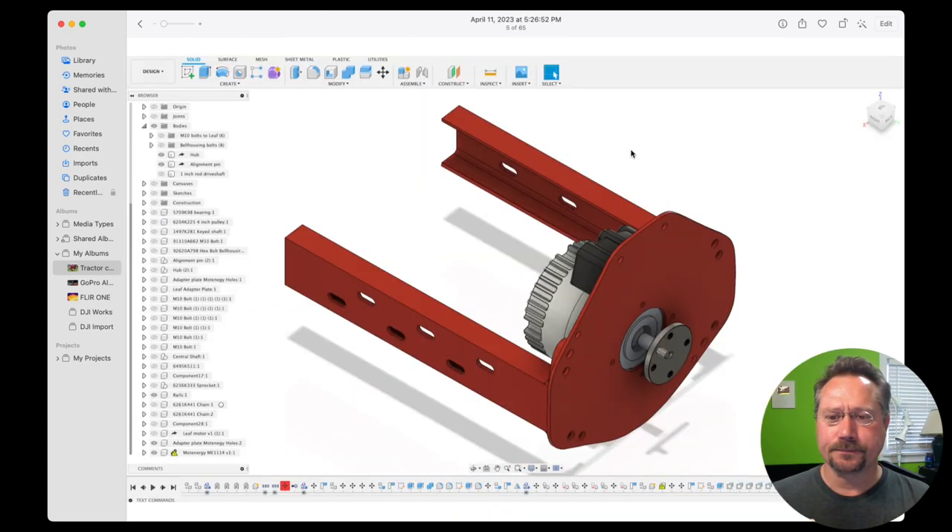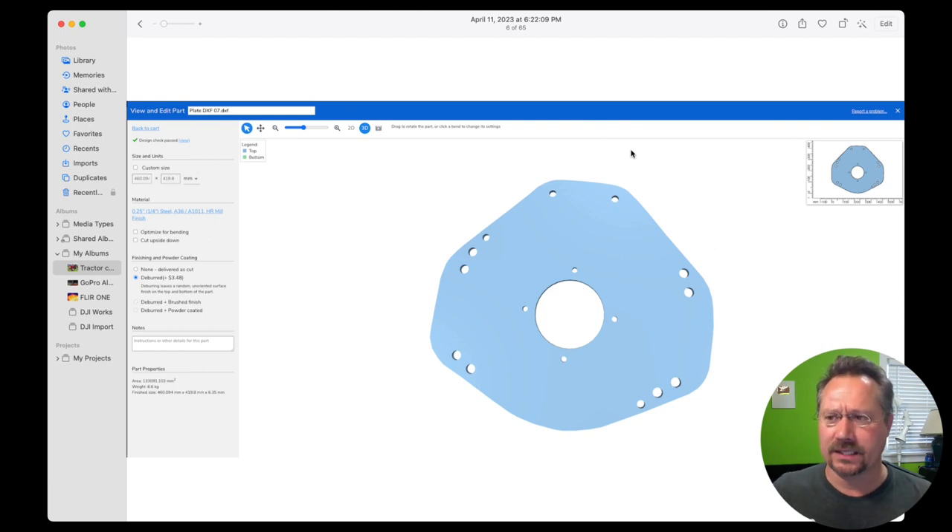The big thing I did recently was play around with designing a plate in CAD. It has the general outside shape of the original motor plate, plus on the inside it has the ring and the four bolt holes for that particular electric motor — also a common bolt pattern so I'd be able to swap in another motor as well. By doing it in CAD, I can export a DXF file and send it to an online service like SendCutSend, where you upload a file and they laser cut, CNC, or plasma cut the part and mail it to you. This looks a lot easier than doing it myself, especially since I don't have a plasma cutter, but I need a really accurate version first.